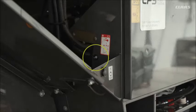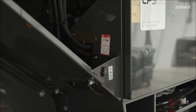If the light is illuminated, please make sure that you do not turn off the isolator. This light, when it's illuminated, is telling you that the machine is trying to carry out its cooling for the AdBlue injector. So the light's on, it's doing its process. When the light's off, it's finished. And only when it's off can you turn off the isolator, not before.